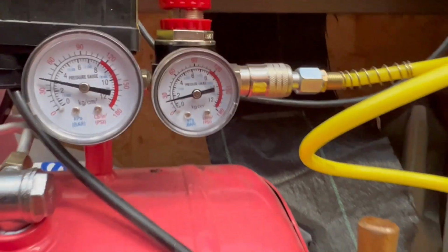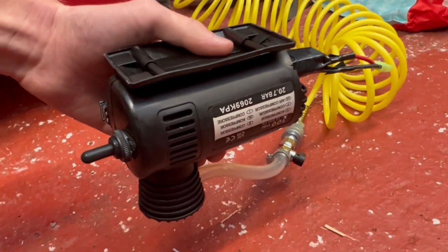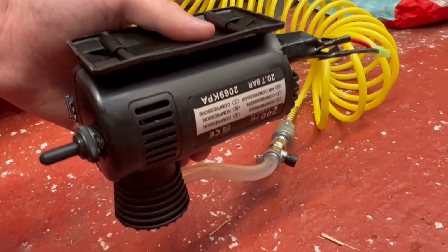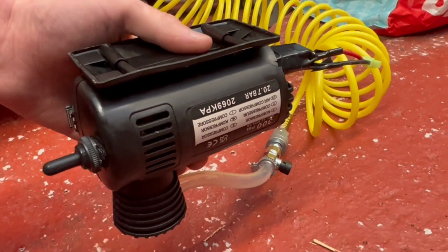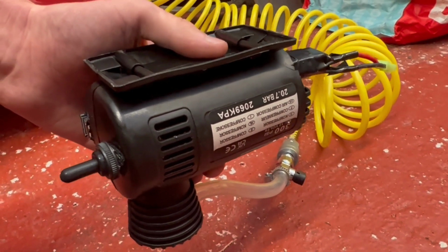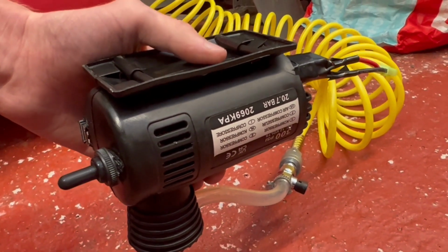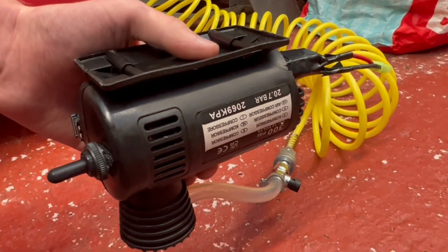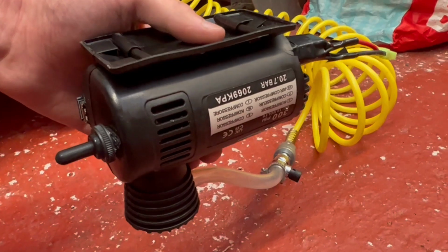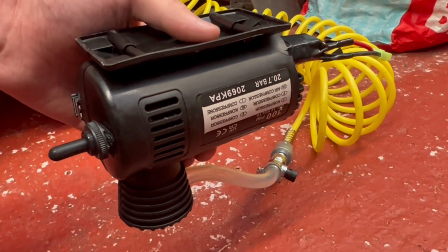Something also worth noting with this little engine is that it operates a lot better upside down than it does if it was stood upright. I believe this is because you've got gravity helping the piston go back down into the reset position before the compressed air enters the cylinder. I also think it helps the ball bearing valve stay open for longer when it's upside down.